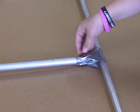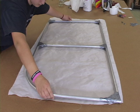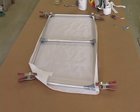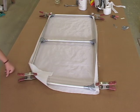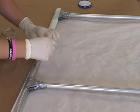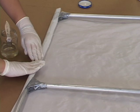Remember, this is a nine-year-old girl who's never seen fabric before, so you can see how easy it is for her to do it the first time. Take a piece of fabric that's at least an inch and a half bigger all the way around than the piece you're going to cover, then lay the piece on top of the fabric. This same principle applies for all of the control surfaces — even your ailerons and flaps. She's going to go around the perimeter and glue to the tubes on the outside of the perimeter. You don't have to glue to the tubes within that area, just the outside. Think of the piece you're going to cover as a picture frame with four sides, and you're going to attach the fabric to all four sides.